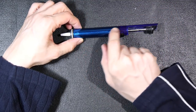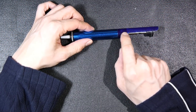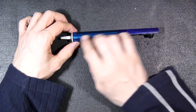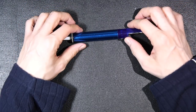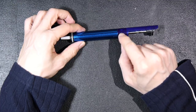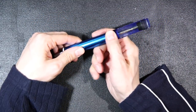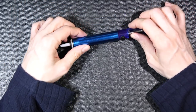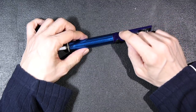Looking at the smaller tool, this is an aluminum cylinder with seals inside just like the other one. The problem is this is a very hard plastic material. In order to clean it really well, you've got to take the top off and the bottom off to get into the cylinder, clean the seal, and put a bit of lubricant on it. But you can only do that so many times because this hard plastic ends up wearing out — the threads wear off. One time you'll find yourself doing this and the whole back end will shoot right out because the threads wear out. That's one of the really big cons of these things.